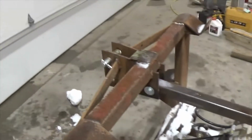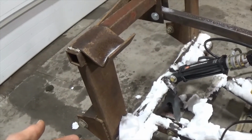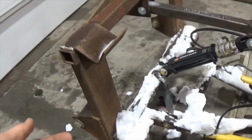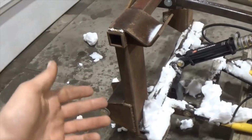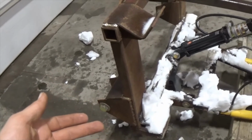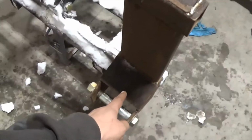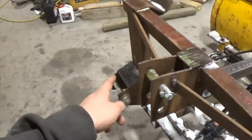Now, I don't know if this is a homemade frame or if this is a manufactured one. So if you're going to do something like this, you want a nice heavy frame. This one's made to pick up 7,000–8,000 pounds. And I've had to touch up a couple of the welds that probably weren't done the greatest, and added pieces like the bracing on these supports.